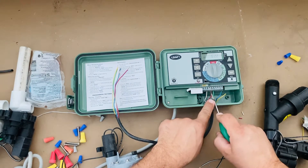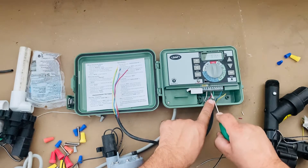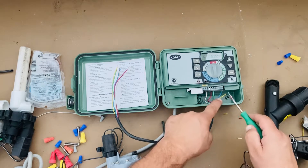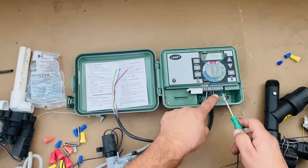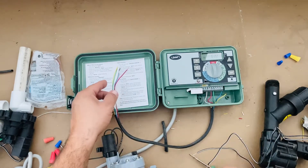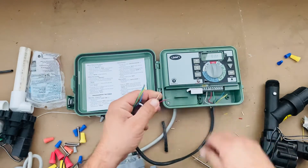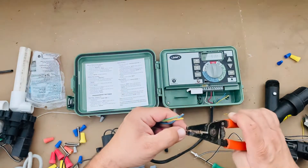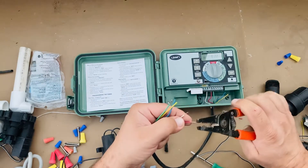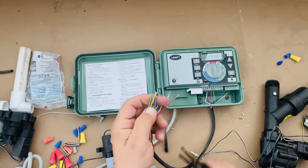Make sure that you can see just a tiny bit of metal at the tip — you don't want too much sticking out. If you have the sheath cut way back and it gets shoved in with wire sticking out too far, if the wires cross they will arc, and that would be bad because you'll wind up shorting it out or running multiple zones at a time when you don't want to. You can fry your clock or cause other problems, so make sure your leads are not any longer than they need to be.